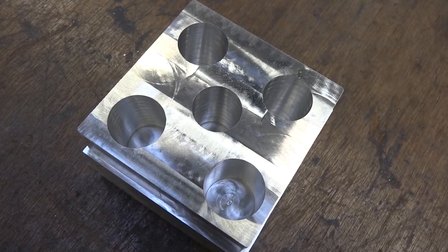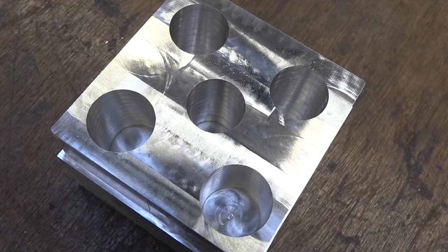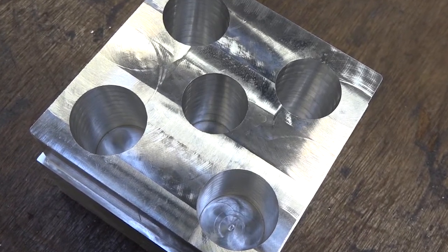When it gets to the bottom of the hole, even though it has the waveform on the end of it, if the insert does a complete sweep — which is handled through the programming — you get a completely flat bottom. That's very difficult to achieve with a more conventional drill, standard point geometry, or a u-drill type that gives you a wave and requires going back down with another tool. If you're not looking for a particularly brilliant finish on the side walls, you get a good finish and can just take the tool away and get your hole in place. We are very excited about it — it's very revolutionary. People are looking at it saying 'what's that?' which shows interest. I think we're on a winner.